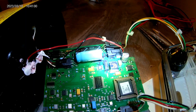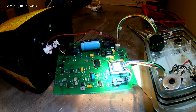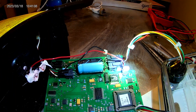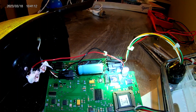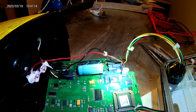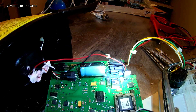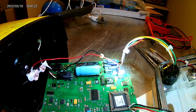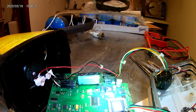I used electrical cleaner and some Q-tips and cleaned it up. It may be that the actual power clip right there is not attached to the board for some reason. If my power is coming into the wires but not making it onto the panel, I might have to try and re-solder that on. The rest of the panel looks really nice and clean, but right there there was some dirt and goop — I don't know how it got there. We're going to look at that, unclip this, check it with the meter, and see what we've got.